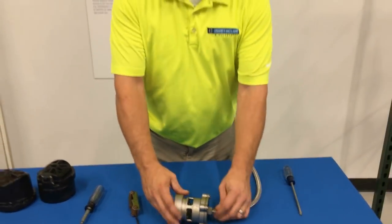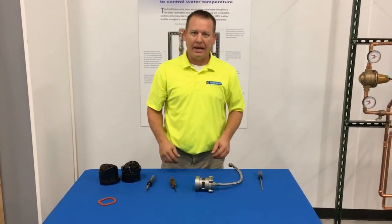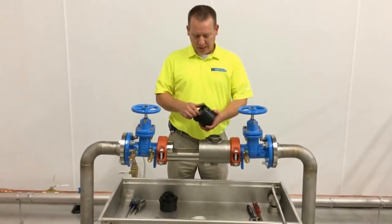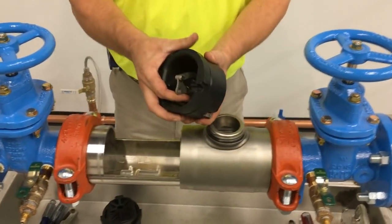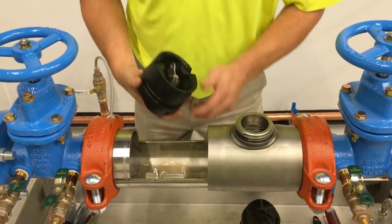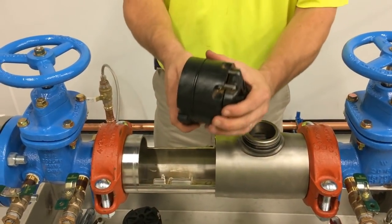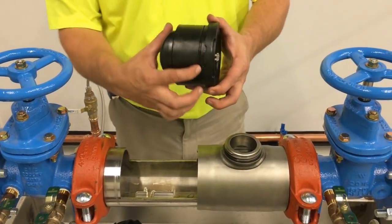Now that we're rebuilt, we'll take all three — our relief, our number 1 check, and our number 2 check — and get them back installed into the device. We're back at the device. Step 1: take your number 2 check. You'll notice the number 2 check, when pressing on this cam, has a lot less tension than our number 1 — so if you get these confused, you're okay. Pull back. This is number 2. Notice this O-ring — this is one thing we will have to inspect.